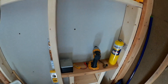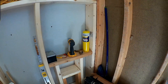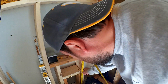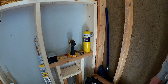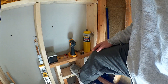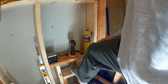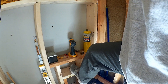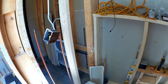It is approximately 18 inches — I will take a tape measure to it. Once you put the mortar bed in place, it's going to be about 15 inches from the ground. That seemed to be the best feel. I'm a little low because the mortar bed is going to raise it up, so it's actually going to be a little lower — probably about another inch, inch and a half once you get everything on there in terms of tile. But that works pretty well, so that's how I framed that out.